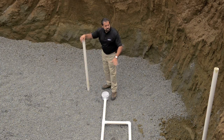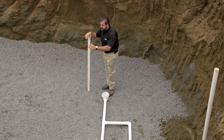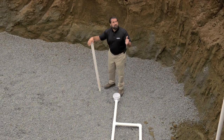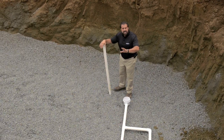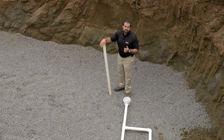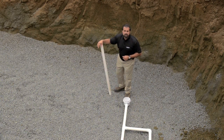That's all plumbed in. We're ready to cage in our gunite pool. You can see I'm standing on a stone bed here — not really necessary, but we have a rain event coming. This is going to give us the ability to cage in this area with steel, and it's going to help resist freeze-thaw, add to the integrity of the concrete, and give us a little bit of a drainage layer.